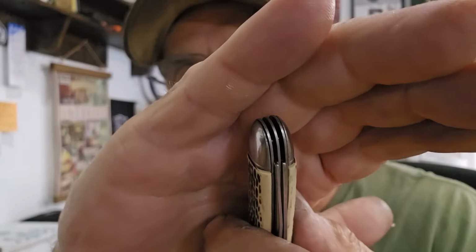And like you saw, it's not your usual clamshell, because it doesn't have the clips on the ends. The clips are inside. And one day I'll show you that. I'll find a real banger to take apart, and I'll show you. But basically you've got two hooks like that, and the hooks are in a hole. The one's already bent, so you put it in, pull it tight. The other one is straight. You put that in the hole and you bend it over, and there it is onto the liner. That's how they work.